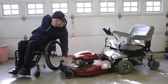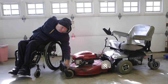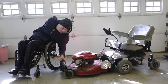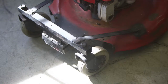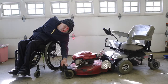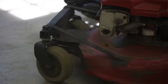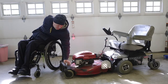The hardest part of this build is to take the existing wheels off and cut the old frame out of the mower deck so you'll have room for the sweep of your casters. Then just build this up — we put a piece of square stock built up to the right height to make the deck level and dropped on some old electric wheelchair casters with a 5/8-inch bolt. Make sure you use a 5/8-inch bolt — you need it strong enough in case you bump into a wall or rocks. Then we put a little buttress brace right here. Fairly simple build all around.